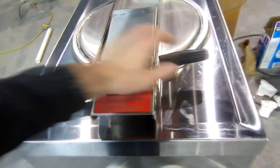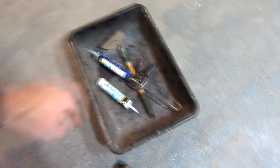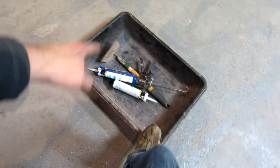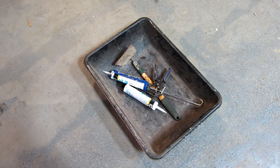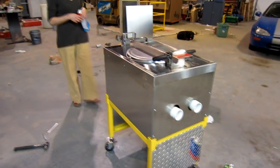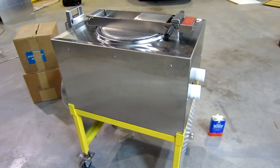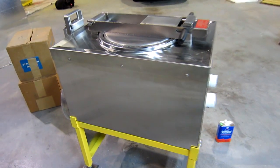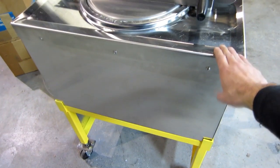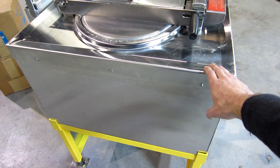The PVC pieces there will get glued and caulked and all kinds of stuff. And if all goes well, you can see out here I've got 2 tubes of caulk, my little 1-arm hoe, and this is the concrete mixing setup, the hoe and the black thing back from Geek House 2. I'm going to be mixing, I'm guessing, about 5 bags of concrete to fill all this space. Now the trick is, it perfectly fits on the cart, so you can't really fuss with it, and I don't want to scratch anything up, but I got to find a way. It's easy to take this off now because the whole thing only weighs about 50-60 pounds. It's going to weigh about 600 pounds tomorrow because we're going to fill it full of concrete.